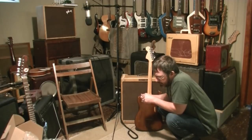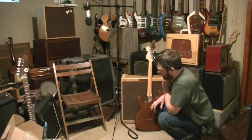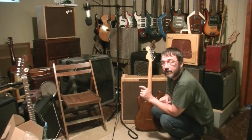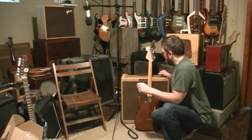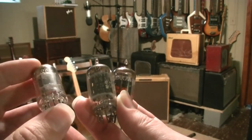And I think a lot of the bad tone of my initial video came from my mic setup, because I'm still figuring that out, and also because of that 12AU7 in that second stage, which I think was a little underpowered. It wasn't really driving signal through the tone stack like it should have. So here's some more tubes we're going to try in our tube rolling venture.